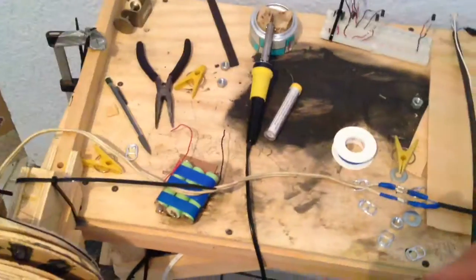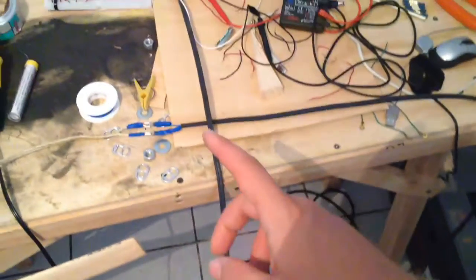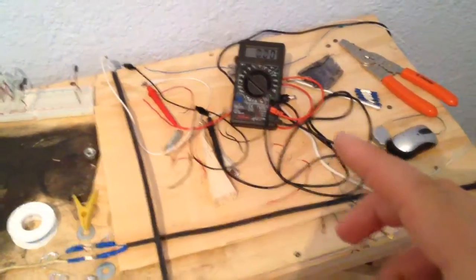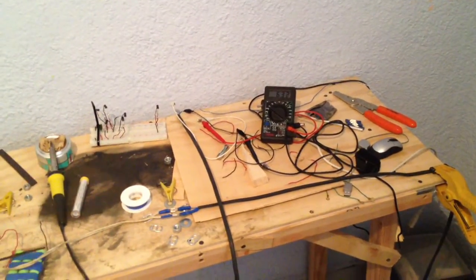It's not a perfect setup — I'll see how that works. I have automotive connectors so I can disconnect the wind turbine off the tower; this length of wire will stay permanently attached to the tower. This is 16 meters of cable — it was internet cable left here, free — it should be okay for a couple of amps, and it'll come through the window so I can record it. I'm doing a little test to check resistance and make sure I get some voltage, and I'll use the Arduino to graph when it's windy and how much power I get.